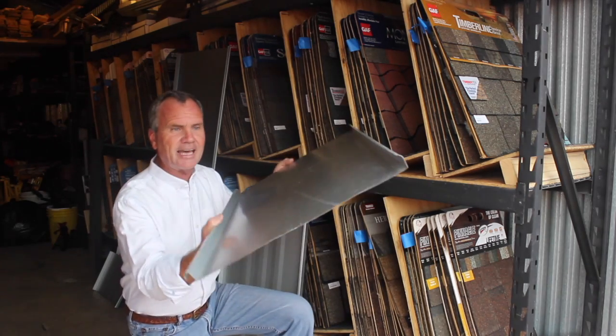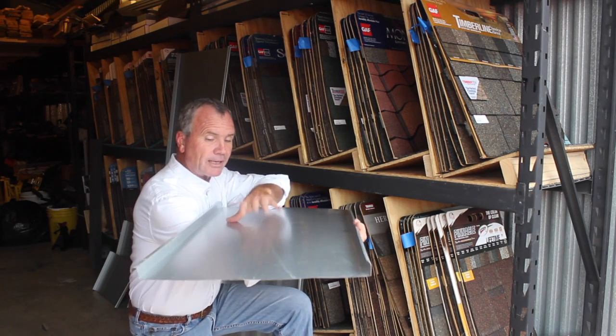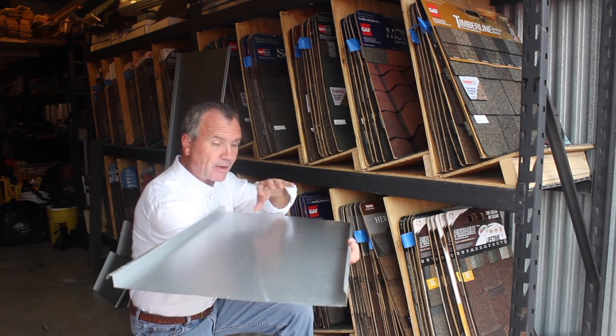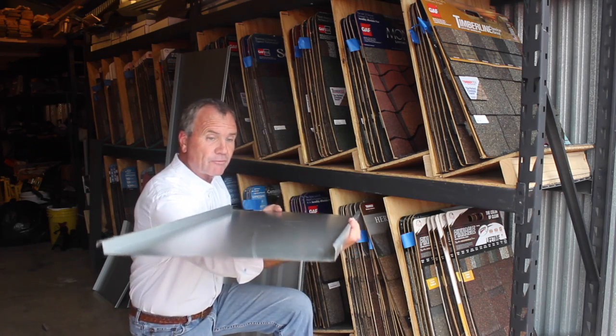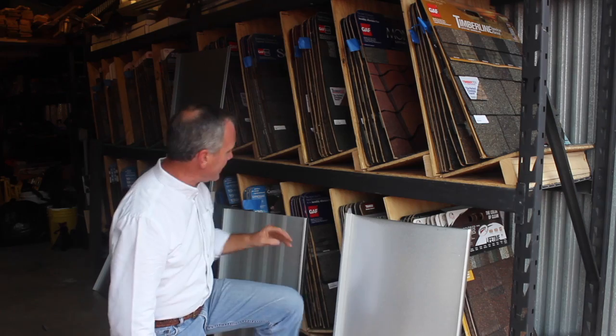This is indeed a flat pan. You can see there's a real beauty to having it flat. The one thing that people do striations for is to eliminate oil canning — the movement of this that is visible from the street. The striations tremendously help do that.